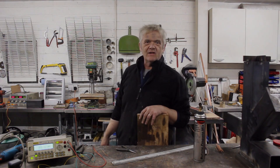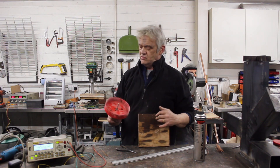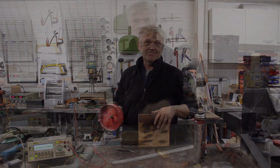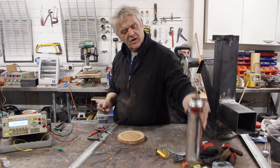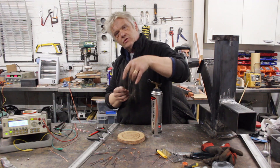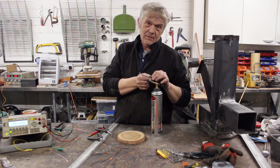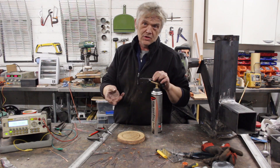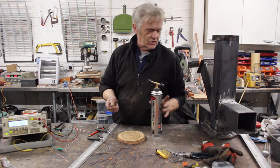We make 16 hairpins in copper like that and then burn the edges and arrange them in a circle. To arrange them in a circle I'm going to cut a disc of wood with a hole in the center using my 150mm hole cutter. We've got a whole bunch of copper hairpins with oxidized ends. When you turn on the flame you'll see a center blue bit and then an outer bit — that outer bit is the oxidizing zone. Hold your hairpin in the outer bit and the flame will go green-yellow, the copper will glow bright red quite quickly and leave you a nice oxide coating.